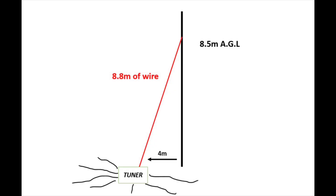Hi there, it's Tim G5TM back for another one. A week or two ago I put out a video about an idea for a portable antenna — a non-resonant sloper, 29 feet or 8.8 meters long, to act as a very gentle sloper fed at the base by a MAT40 remote long wire tuner, with some ground radials, to cover all bands from 40 through 10 meters.